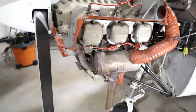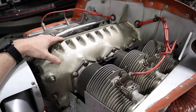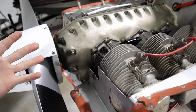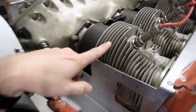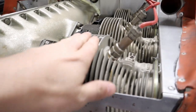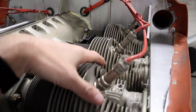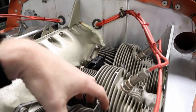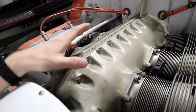Here's our engine — it's a Continental O-300D model. It's six cylinders; you can count them, we've got six all the way across. Some engines have four, some have six — this one has six. It's air cooled, so you can see the little vanes running along it. When air is blowing through the cowling it runs through there, and here's the baffling that seals everything off so it forces all the air to go through in between the cylinders and cool everything off.